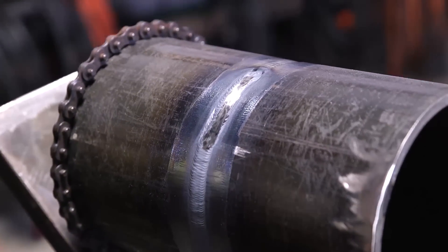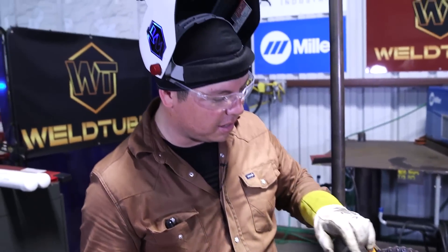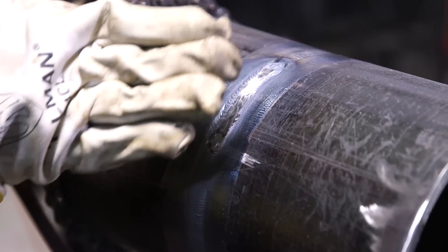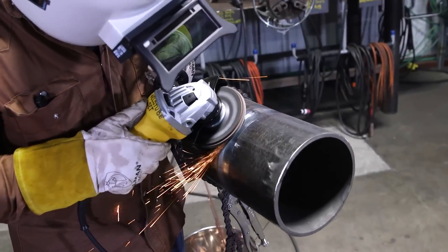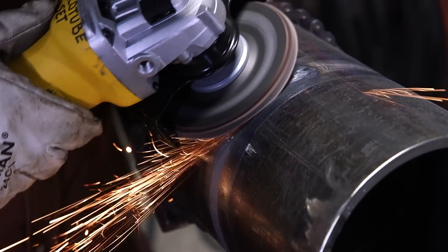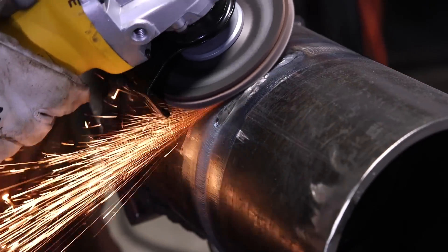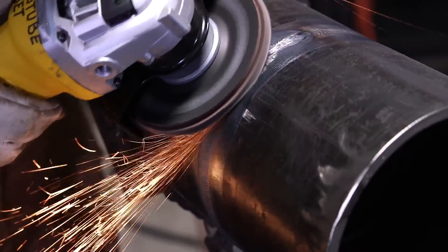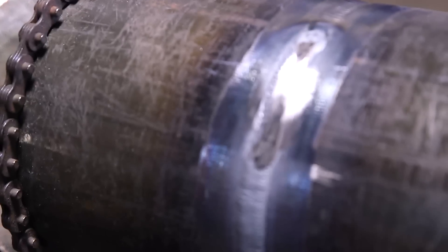I'm going to put our flap disc on here. On the side where I veered off, it's not in line with the rest of this cap. I'm going to lightly hit it with this tiger disc just to erase that marking where we went off. A lot of guys will just run that TIG rig over and kind of wash it over and comb it over to make it look better. To me that's really noticeable - I'll know when somebody did that. So go ahead and grind it and fix it up.